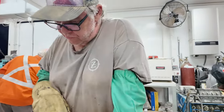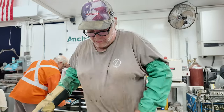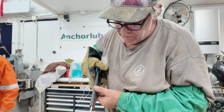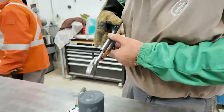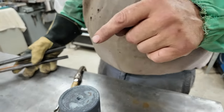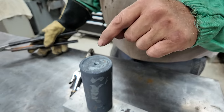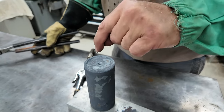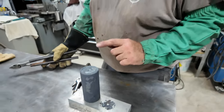There's a relief in the backside. Still popping, it's like popcorn. We gave it a center, which is all full of scale, but the center gets lapped on the milling machine. You use a carbide 60-degree point. We lap it with a carbide center with a little bit of lapping compound, and lap that center and the opposite center nice and square with each other, so when it's spinning in the fixture, it runs very true.